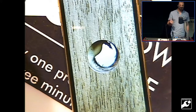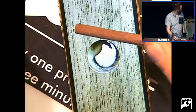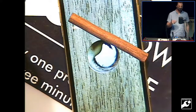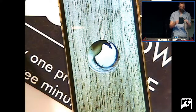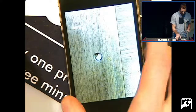Now you can't just grab a dowel off the shelf and drive them through. If you do that, the dowel will snap and it could go through your hand, so you have to make the dowels yourself. The dowels you make for this are riven, so they're terrible looking dowels. It's not straight or anything, but the important part is it follows the grain. So you split them out and drive them through what's called a dowel plate, which is a hardened steel plate that cuts the thing round, but in no particular straightness. And these will bend around corners just fine. So that's kind of cool.